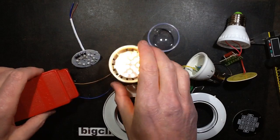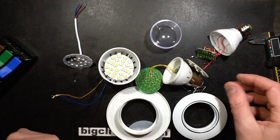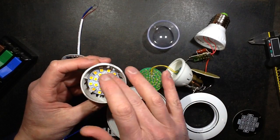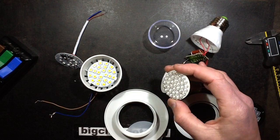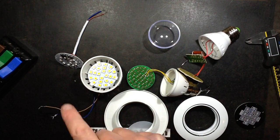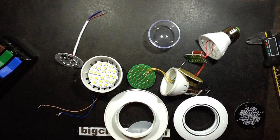I really like the fact that it suddenly becomes very hackable — if you wanted, you could put this in there or you could put this in there. There's not a huge amount of space at the back of the circuitry, but it does open up possibilities for hacking and modifying these lights. It's quite appealing that they have actually standardised on some circuit board sizes. I'm going to keep an eye out on other products and measure all the circuit boards as I get them, because I think they have standardised on a series of sizes that are then just fitted into various manufacturers' lamps.